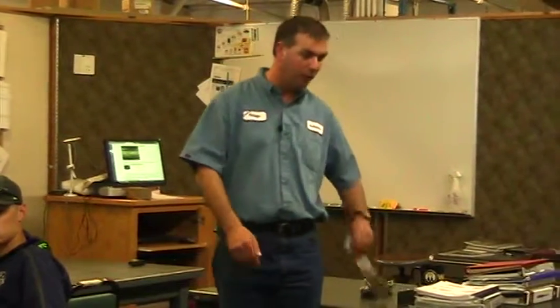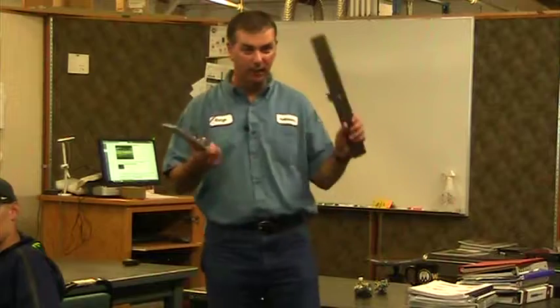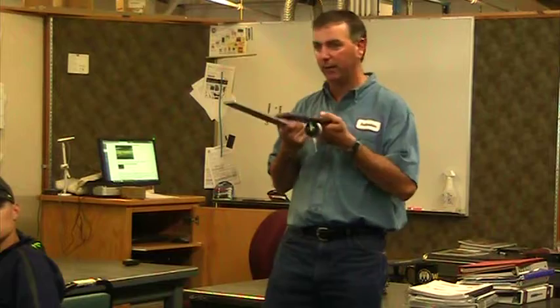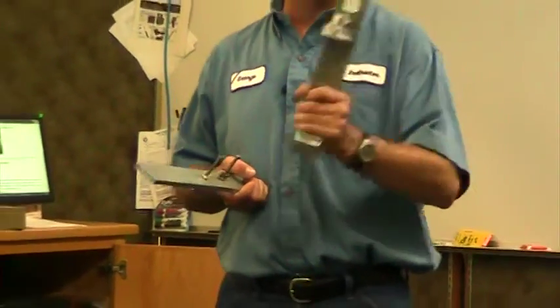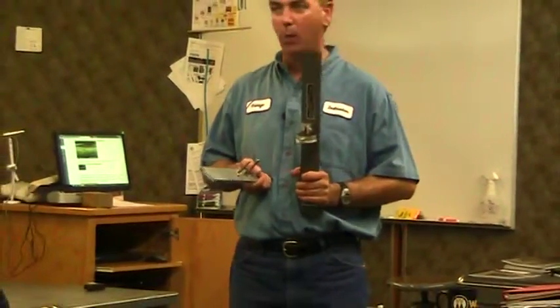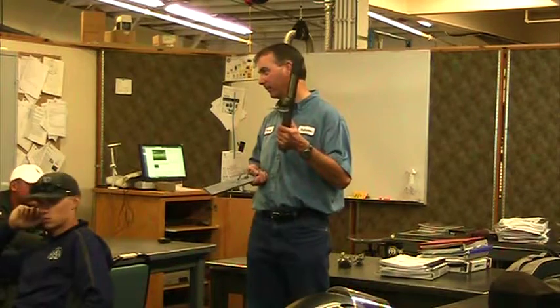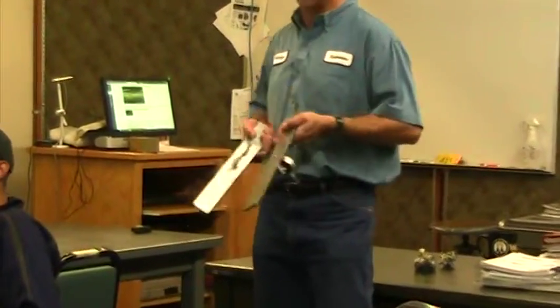And so as a technician, when we're setting up a cutting unit, we're going to be using some kind of instrument, gauge bar, something to actually check the height. Superintendent says we want that at 3/8 of an inch, or we want it at 90 thousandths of an inch. We have a tool that reads down to thousandths of an inch, and we set that at 90 thousandths of an inch. When you go out there on the golf course and you're actually mowing, are we really mowing at 90 thousandths of an inch? Most of the time we are not. Most of the time we're going to mow at some other height other than 90 thousandths of an inch.